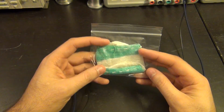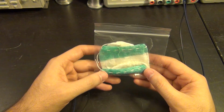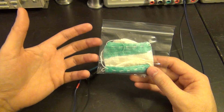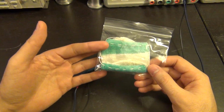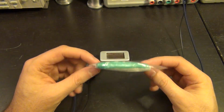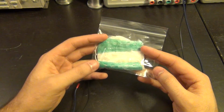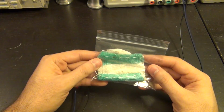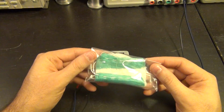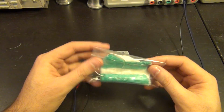The reason they use that is because these rare earth oxides have a very high emissivity in the visible range. So unlike some of the other materials, when you heat them, they don't emit as much infrared light as they do visible light. And of course it's visible light that you're interested in because that's the one you can see. Nowadays they use other types of rare earth oxides which aren't as radioactive, but thorium dioxide is radioactive, and therefore we can use this as a source for our alpha and beta particles. And even though this is in plastic, some of the particles will still escape.